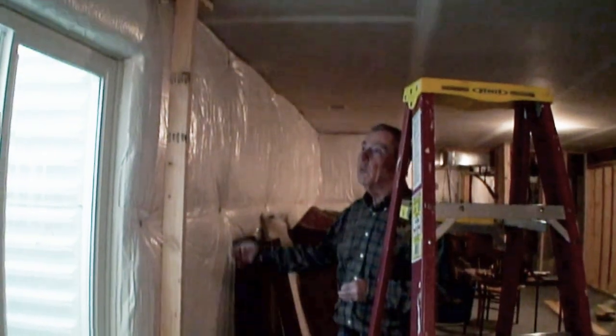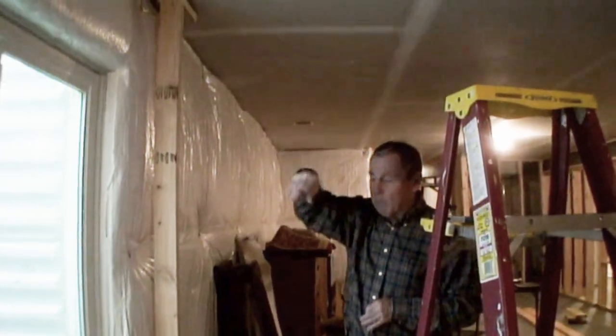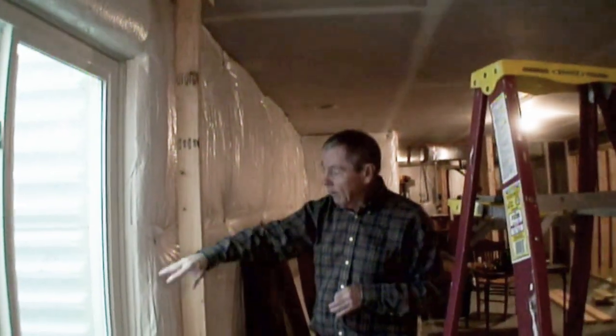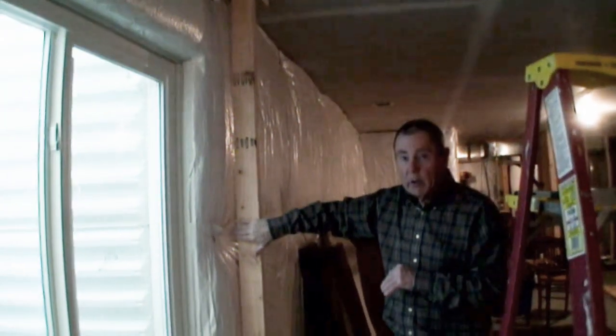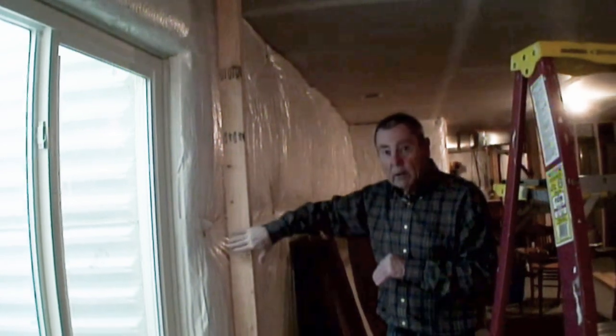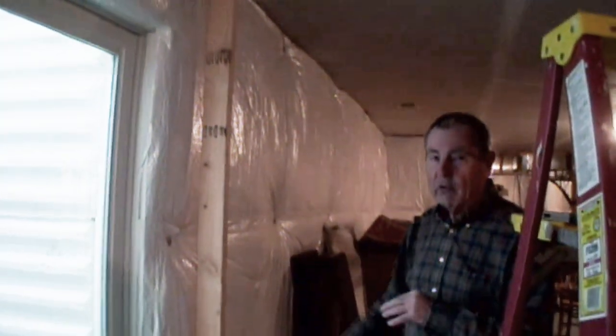So then you're going to be putting a bunch of studs in. What other exciting things are you going to be doing today that are riveting? Riveting, nada. Nothing riveting for today. Putting those studs in will probably take me a little while, and then I'll be ready to start measuring. I'll probably put the top in, put that across, and then put the boards that come down this way, just trying to line everything up so that I can attach the sheetrock to the board on one side, have it go all the way in and just sit there. Probably put a bead of caulk so that it has something to adhere to.